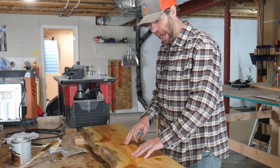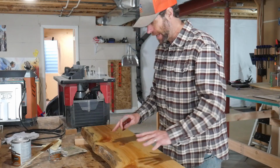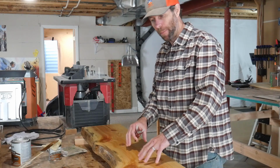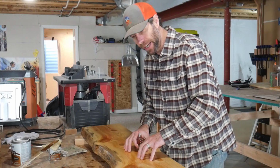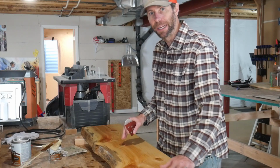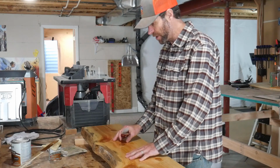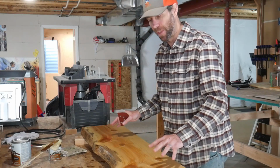The reason you have a rough finish is because once you've sanded all this out, as we did, the grain of this wood has opened up, and when it gets that polyurethane in it, that grain actually swells. And when it swells, it creates that rougher surface again. We need to settle that grain back down. It's okay, buddy. We're going to cover you up and make you nice and pretty, but we've got to calm it down. It's almost like inflammation in the body.